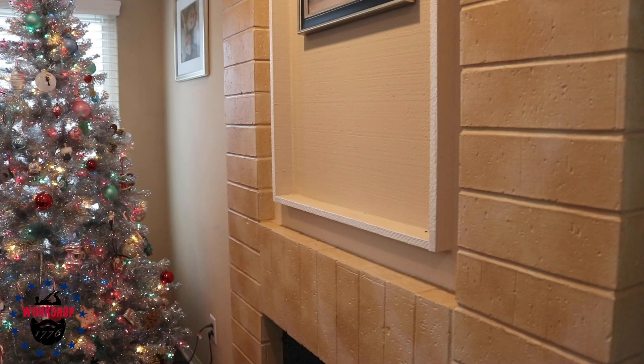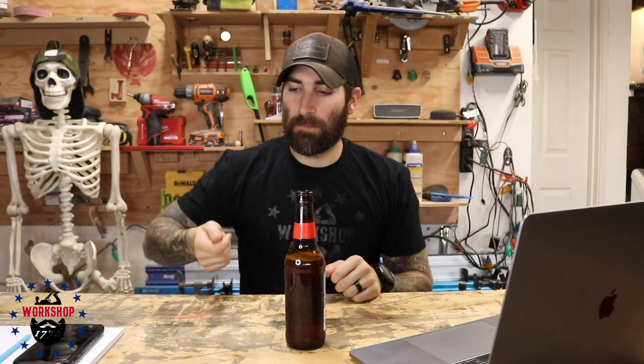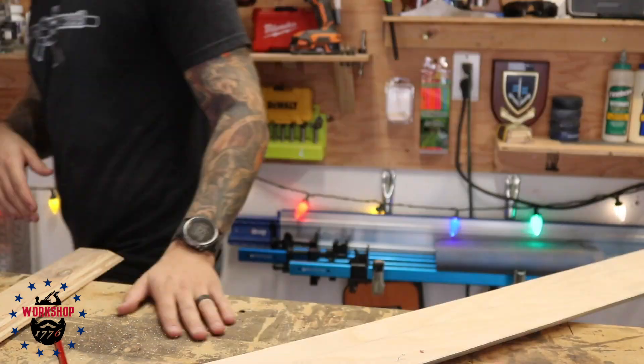So for this part — this is the top piece — she wanted it to run even with the bottom section of the frame. What I ended up having to do was take this box and cut a notch out about three or four inches in from the sides, about halfway into the top of it, so the back half of the mantle would meet the forward half of the frame. I'll explain it in a minute. I was kind of at a loss for what to do here, so I took my jigsaw and notched in halfway on both sides, trying to figure out the best way to cut out that middle section.